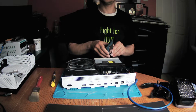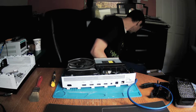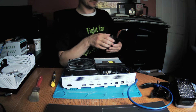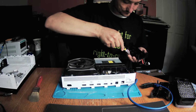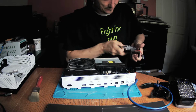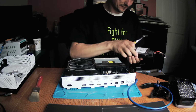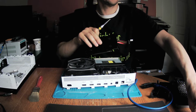So let us remove it. Let's find another Xbox One, or that's 500 gig. One terabyte. Okay, we've got 1 terabyte. Let us test it out. Let's take it out. That's from Xbox One, not Xbox One S. So we need to test it before assuming that it's a good one. If we can see it inside the Windows, let's put it aside.